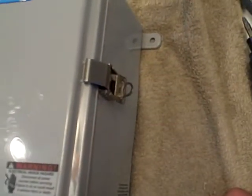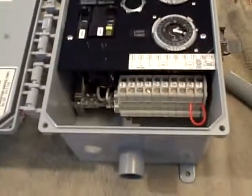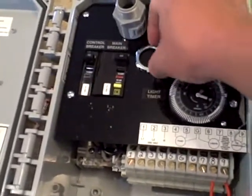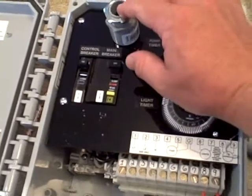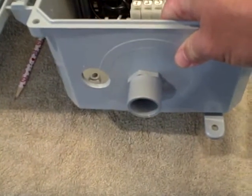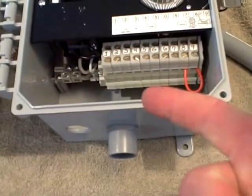It's a stainless steel clasp on the exterior and it is lockable. To enter the new C85 panel, we're going to use conduit and male thread adapters, and then a threaded washer that's going to go on after this is placed through the bottom of the panel. To get into the panel you're going to need to drill a hole for each cable entry — one for incoming power and one for the pump.